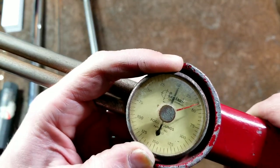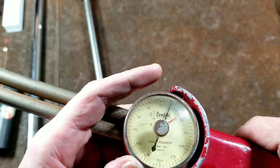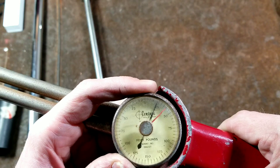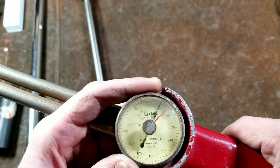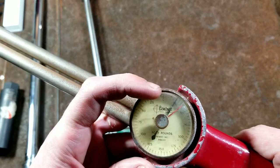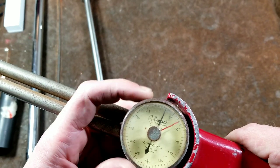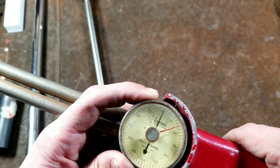What still works is this friction dial, which you can set in various fashions. Say you're working counterclockwise — it might be easier to set it at 25 foot-pounds and then just wait until the needle hits zero going counterclockwise, and you know you've applied 25 foot-pounds. That's what's always kind of nice about this feature.